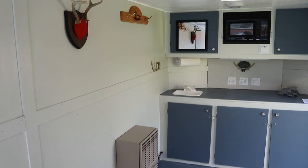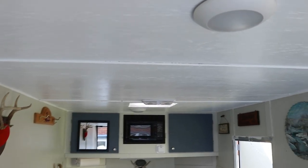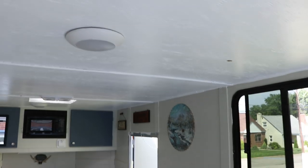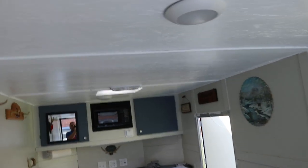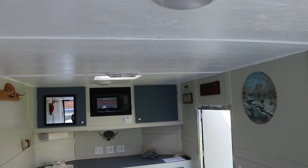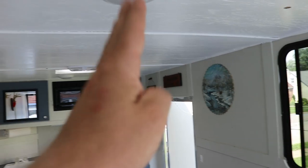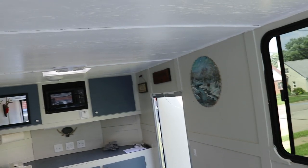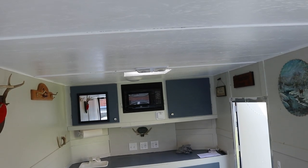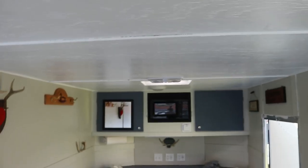The insulation worked out pretty well. For the ceiling, in my opinion the ceilings are usually the weakest point of these trailers. I was actually able to reframe it — I ran two-by-threes across with the existing frame, then ran supports up and down in between, and then ran cross braces between my new supports. The roof itself is now a lot better supported than it was. Because of the center supports I had to offset the lights just a little bit, but that's not a big deal.